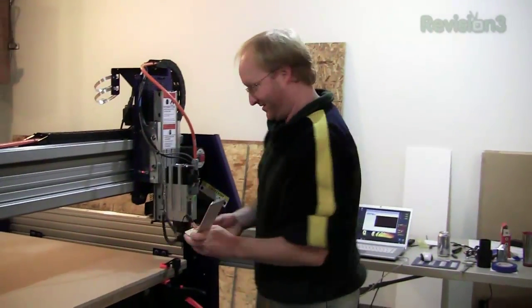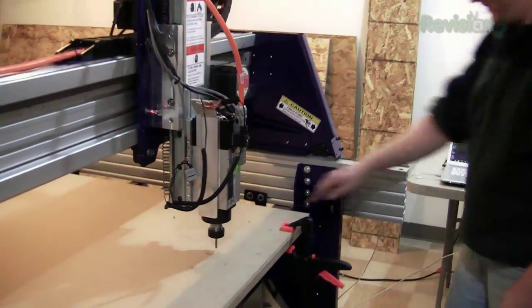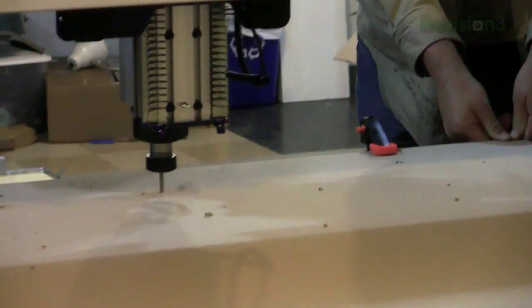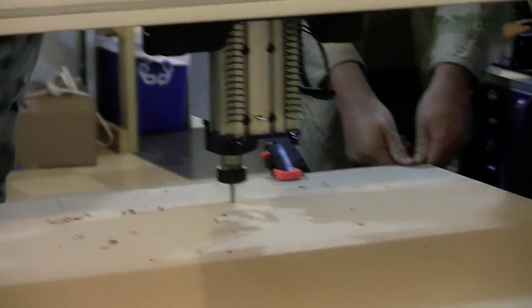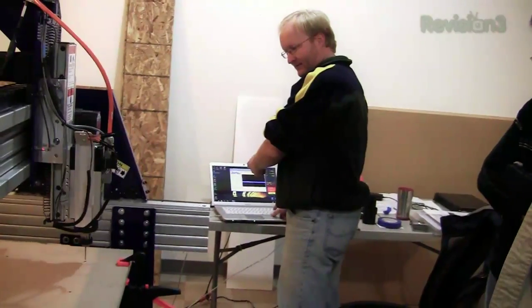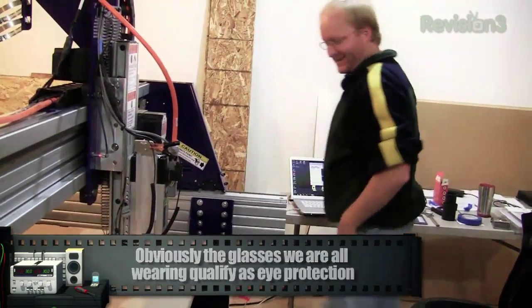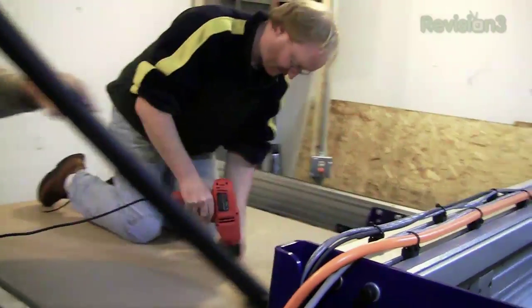I'm getting ready to actually cut some material. Our next step is to cut holes in all four corners of the table to make sure that the machine can operate at its full four-by-eight-foot size. The top layer of MDF board is the sacrificial material — the work surface that will get banged up along the way. We have the machine drill countersink holes into this, so that when we put the screws in to secure the table, the heads of the screws will be deep below the surface so we won't hit them with the bit later on by accident. There's a casualty along the way, though — the fan blades on my favorite drill just blow up out of nowhere.